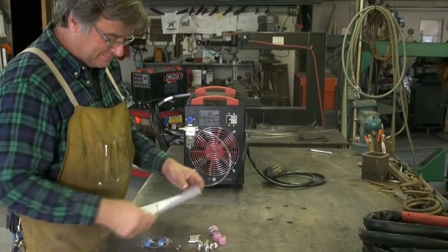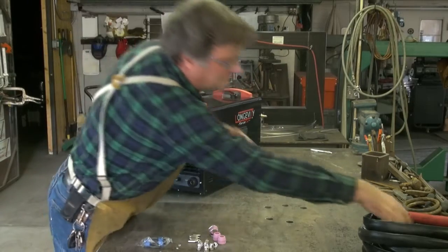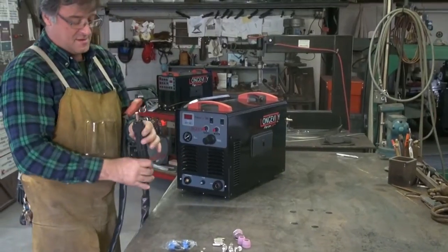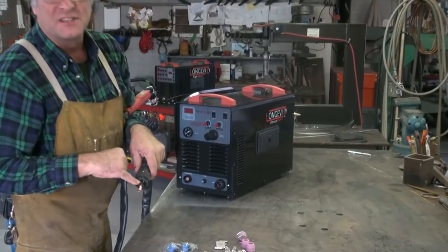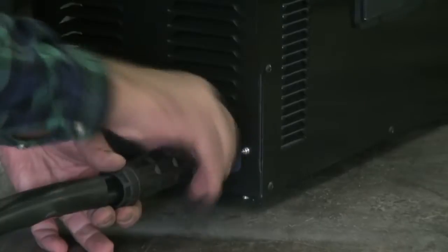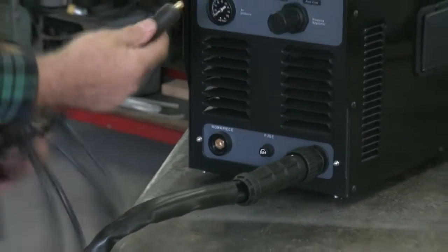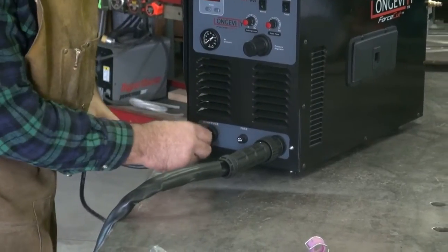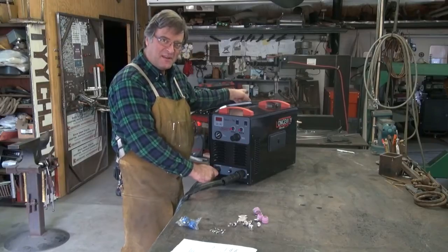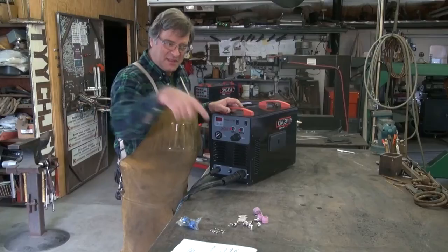Let me show you how to hook the torches up. Nice long torch, nice long lead on it. You line it up with the little plastic boss at the top. That's it — torch is ready. Let me get the ground. Again, the notch goes at the top into the hole, three-quarter twist, and your ground is on. So now you've got your torch on, you've got your ground on, you've got power at the back. All I've got to do is bring the air hose over, plug it in, plug into electric, ground out a piece of metal — we're good to go. Let's make some sparks. Grab your helmet and I'll show you how this thing works.